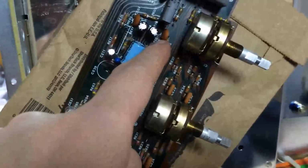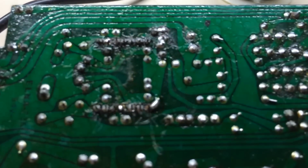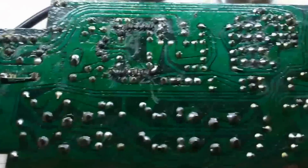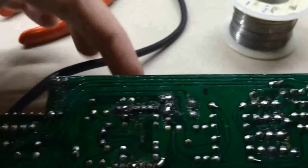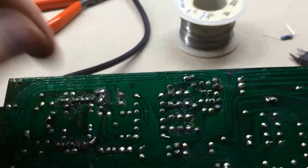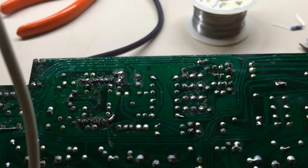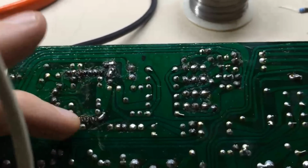You have to, I tell you, with these things flipped over, let me show you here real quick. You basically end up with a soldering gun, having to touch each one of these little places, and then you have to use a solder sucker, something like one of these, and pull out the solder on each and every one of those. And even when you do that, you don't get it all. So you end up sitting here with a pair of pliers like this hooked on the other side to the actual chip, and you end up with the soldering iron on this side, kind of touching little spots to heat them up, and kind of wiggling on the other side to break that thing out. It's kind of like as a kid pulling a tooth, you have to wiggle it. Similar stories. It's about a 10-minute ordeal on each one of these.